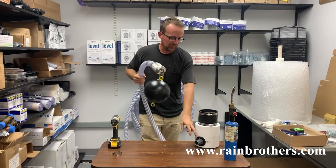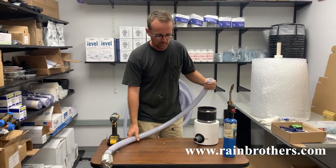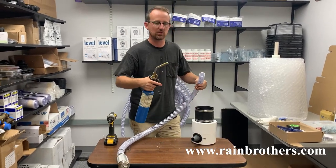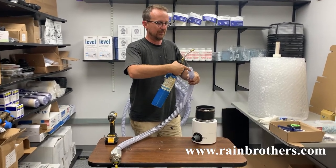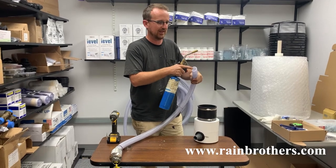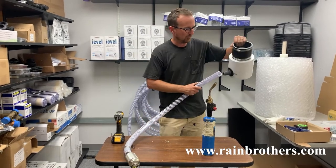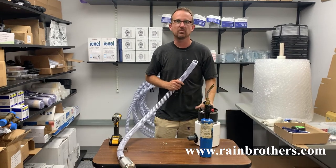This portion is a little more difficult and you will likely want to dip it in boiling water or use a torch to lightly heat up this pipe. You don't want to catch it on fire — you just want to heat it up from the inside to soften it. Add a little dish soap to the barbed fittings and at that point it should slide on very easily and you'll be ready to go.